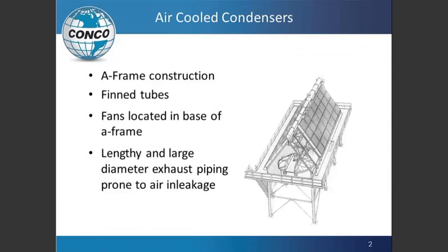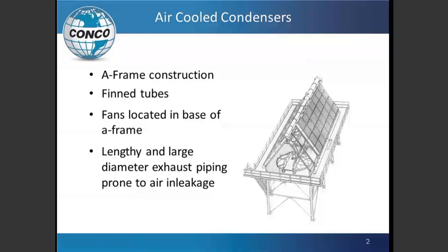Let's start with an overview. The air-cooled condenser itself — what we see almost every time out is an A-frame construction. It's got fin tubes that come down from the steam header located at the top. Those fin tubes can be multiple layers of fins — one layer, oval or circular in shape, or up to four and five layers. The fans are located in the bottom part of the A-frame unit, picking up air and blowing it up through the fins to cool and condense the steam, much like a water-cooled unit only using air. One of the issues is that these units sit out in the elements, open to all that Mother Nature can throw at them.